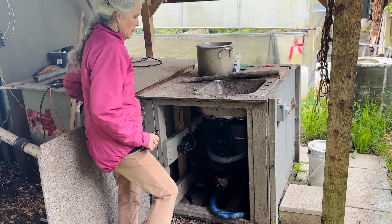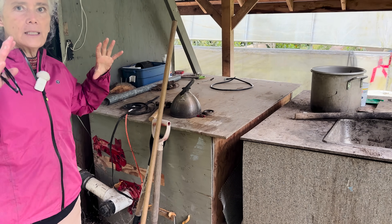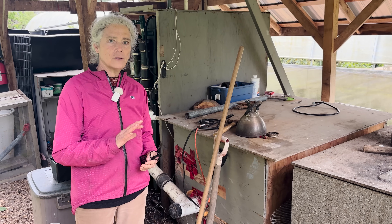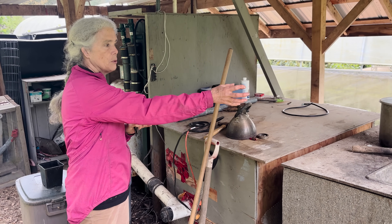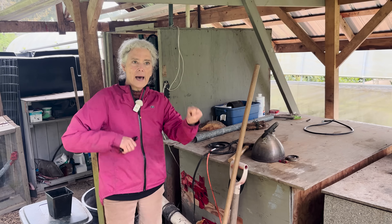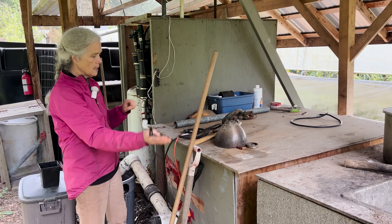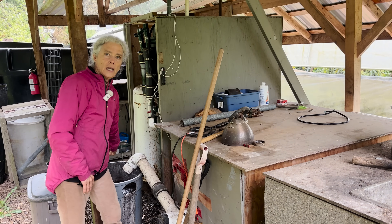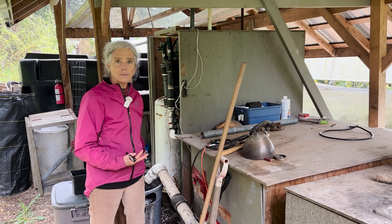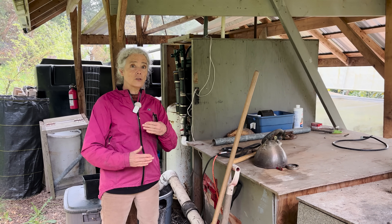The bilge pump pumps from this tank into the anaerobic tank, which is in here — completely sealed, no oxygen getting in. It simulates a cow's stomach by maintaining the temperature of a cow's stomach. Initially I put manure in to get the right biology established. This tank also has a paddle to keep it in suspension, and every time that pump sends slurry in, it overflows the same amount of fluid into this bucket here — this is my finished fertilizer digestate.